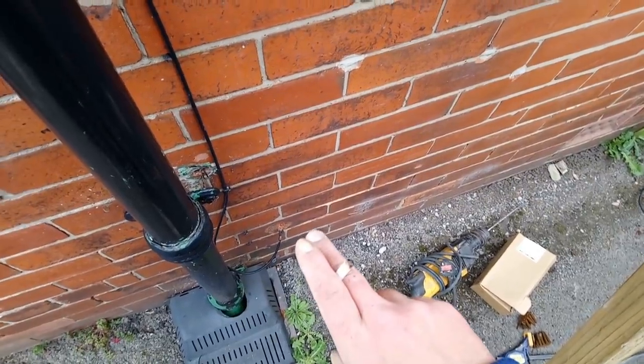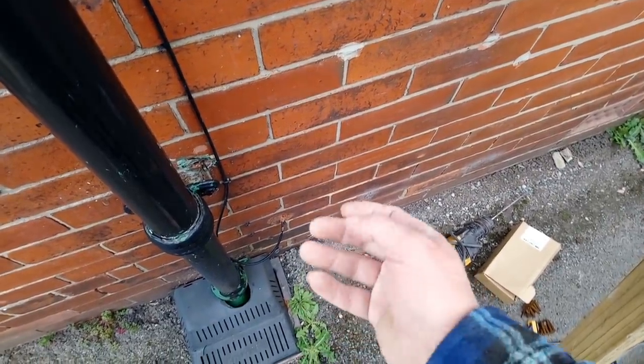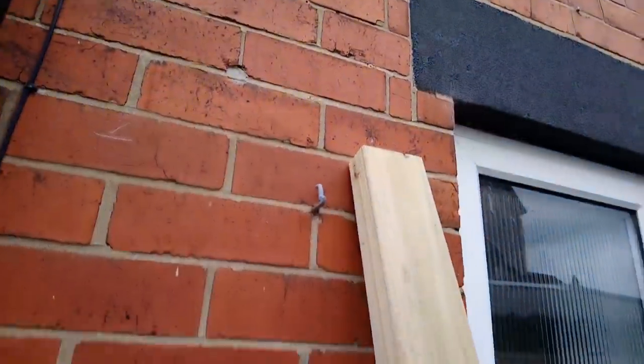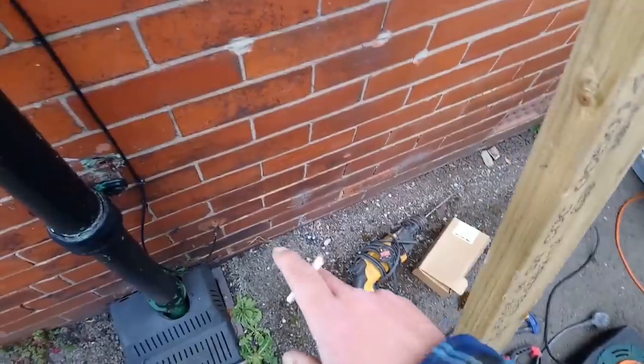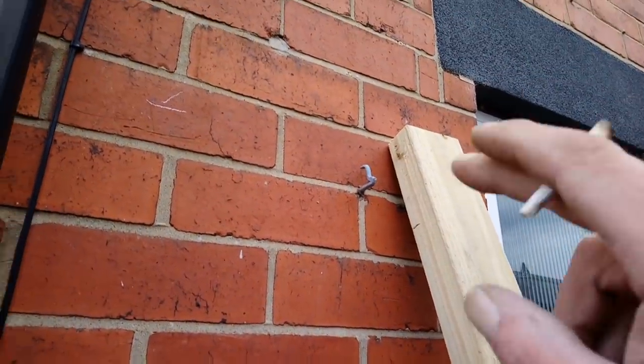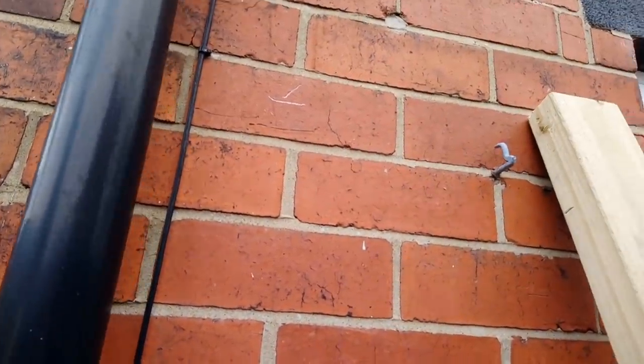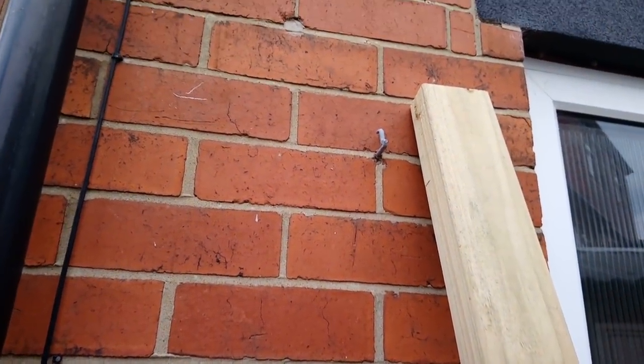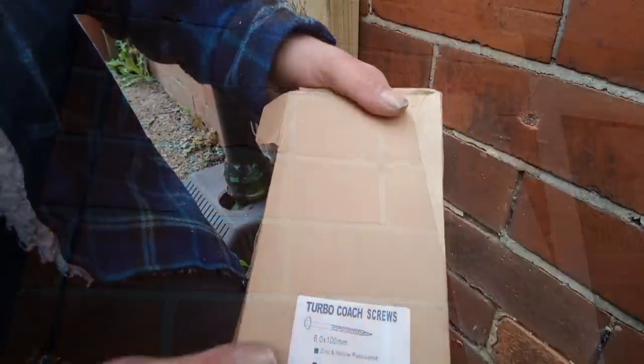I could leave it a couple of inches off the floor, but it's still sort of humid down there, so I think I'm going to put the treated end down, because that always rots down at the bottom there. And the top, I'll just put loads of treatment on it. It'll soak into the end of the fibres. It'll soak into the end grain.